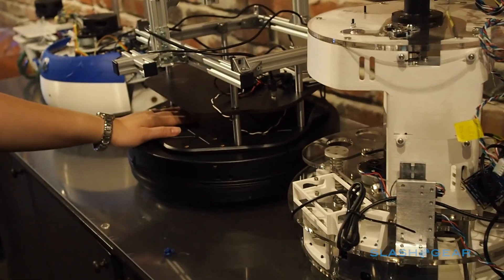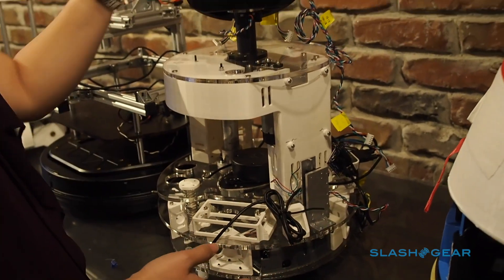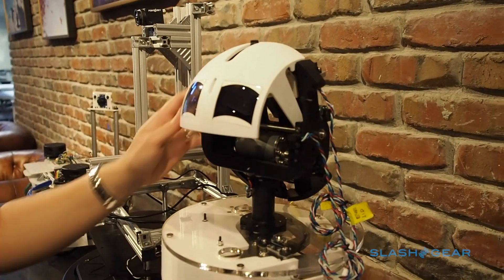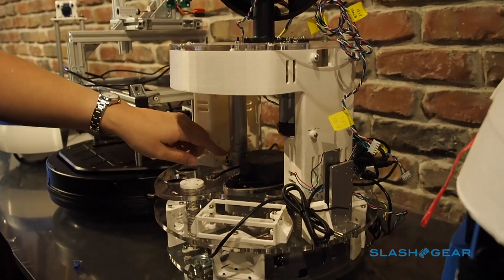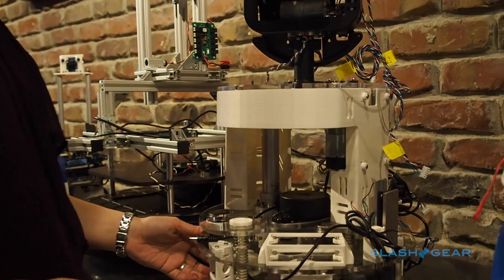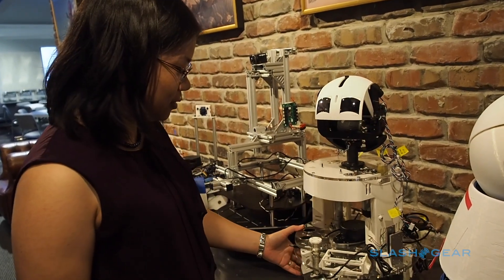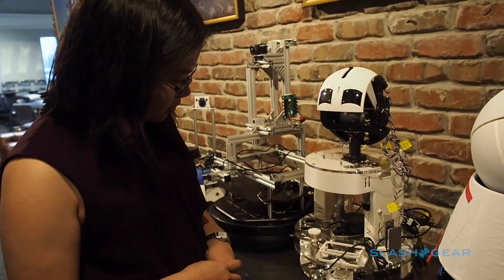This is the first integrated robot that was able to both have animation degrees of freedom and also drive around and navigate. You can see the eyelid degree of freedom and pan and tilt. At the time we also had this lift degree of freedom — you can see the linear actuator here, and there's a motor that causes the whole torso to go up and down. This made it able to lift a little and brighten when it sees you, so it looked happy to see you. It looked really cute, but it added a lot of complexity and cost, so we had to abandon that degree of freedom.